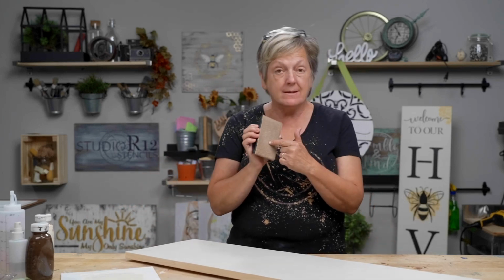And what I want to do is show you a really cool technique. We're going to wet sand while the paint is drying with our really rough grits. That's 60 grit sandpaper on our sanding block. We'll put an affiliate link in the description. And this is going to wreck this piece of sandpaper, but it's a really great technique.